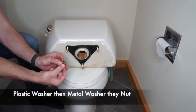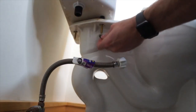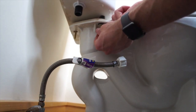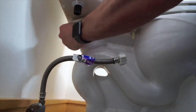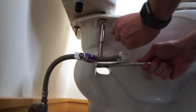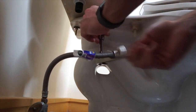For tightening the tank back down to the bowl, there are two washers: the plastic one goes on first, then the metal one, and then the nut. Slide the tank back on where it goes, put on the plastic washer, then the metal washer, then the nut. We're going to tighten these with our fingers first — get them finger tight on all three — and then tighten them down with the ratchet. Whether you're using a socket wrench, a crescent wrench, or a pair of pliers, do just a couple of turns on each nut and rotate around evenly until the tank makes contact with the bowl.